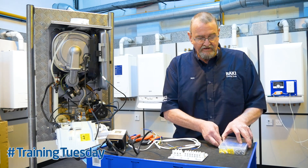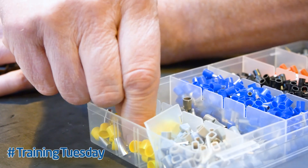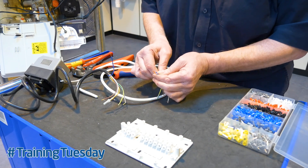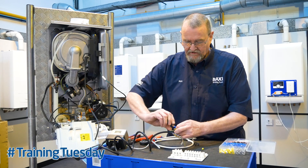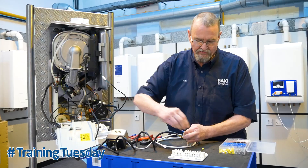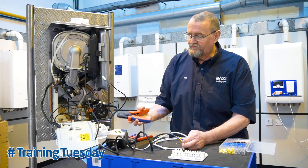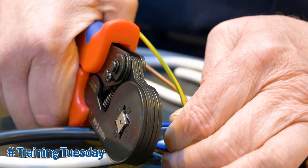So one of the things I use are these bootlace ferrules. I choose an appropriate size ferrule which will take the four connections. I get my four neutral connections, put them together, just put them nice and loose. When we get them in, give them a wrap round so you're forming a cone, the ferrule then goes over the top covering the wires, opening the crimp — once the crimp is down onto the side there, squeeze it down.